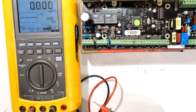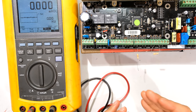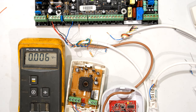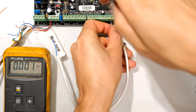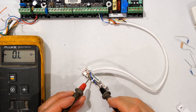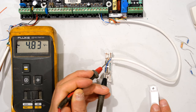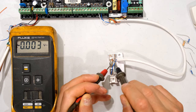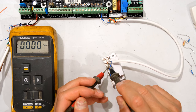Now I'm going to show another method — using your actual sensors, your PIRs or magnetic door switch. Let's test with a zone connected, starting with the magnetic door switch. Across the terminals my meter reads 4.8 volts, and when I pretend to close the door — close the contacts — it becomes zero volts. Keep in mind that most alarms require an end-of-line resistor.